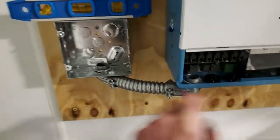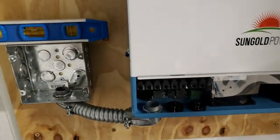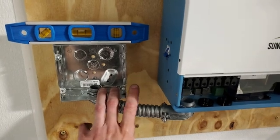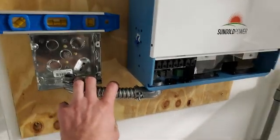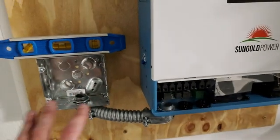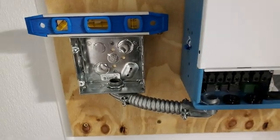The goal is to come into this with a 30-amp circuit. I think it can actually do 40 amps at 120 volts, so we'll probably come in with 30 and leave with 30. I don't want to put more than 30 on it — if it's rated for 40, 30 is fine. Here in the US, jumping from 30 to 40 amps makes everything — the breakers, everything — a lot more expensive.